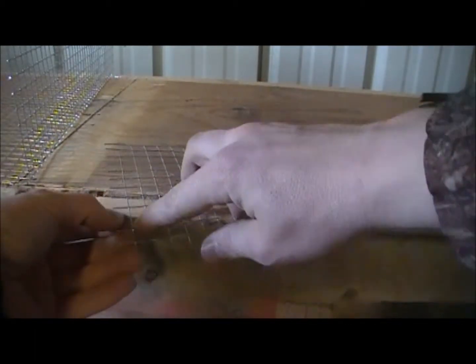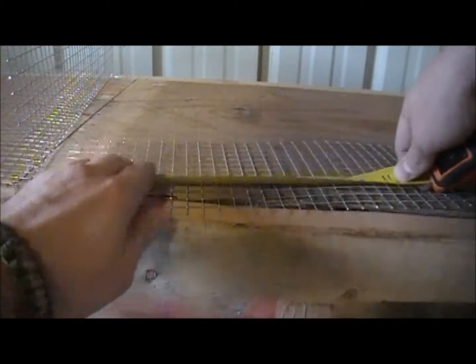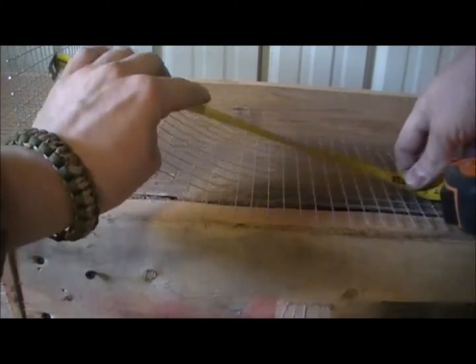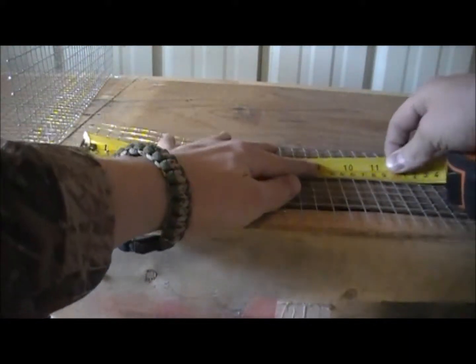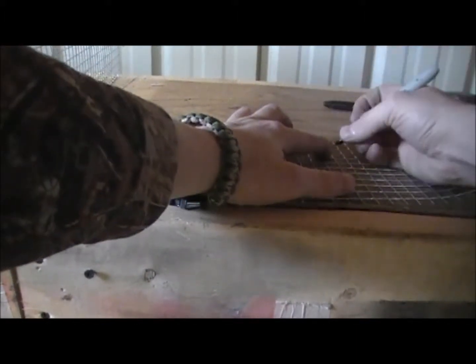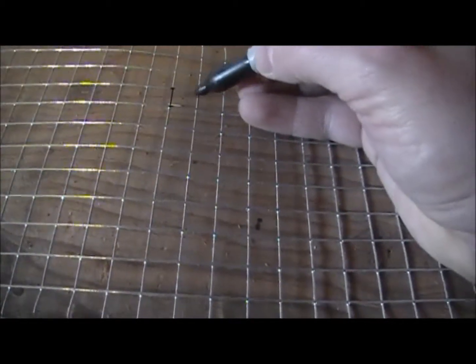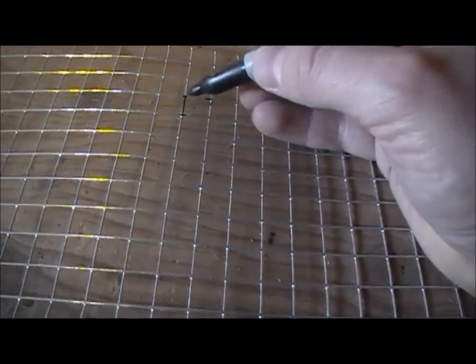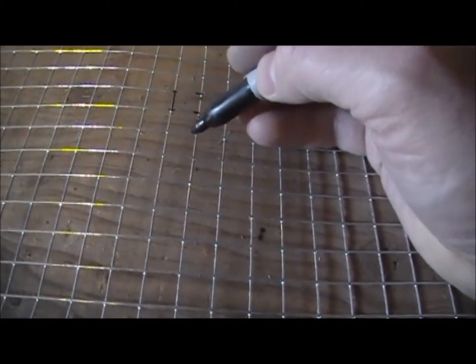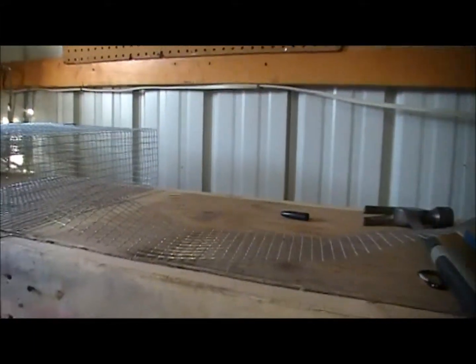This is the one we had the tabs on, but we're not going to measure from the edge of the tab — we're going to come into the first piece of wire and measure 11 and a half from that first piece of wire. This one's bent so it's going to fight me the whole way. I'm just going to come in 11 and a half and mark it quick. Here's our 11 and a half inch. What we're going to do is cut this so that these tabs are on this side and on this side, cutting right along this edge, so we have tabs on this side and tabs on this side — because this is going to be secured and tight and we don't want it to come in loose. I'm going to cut that quick and then show you the finished product.